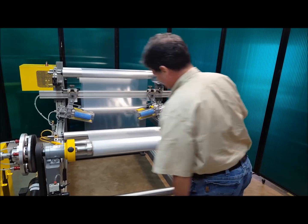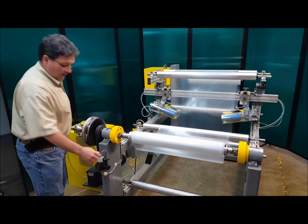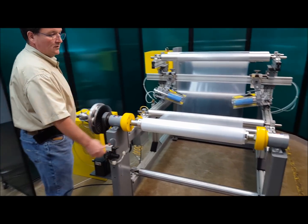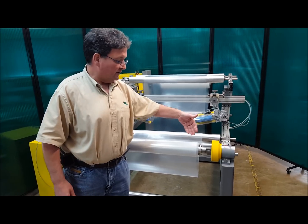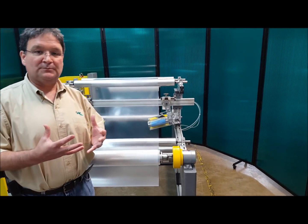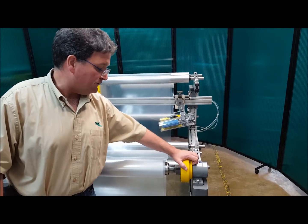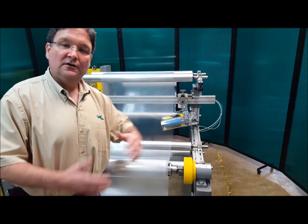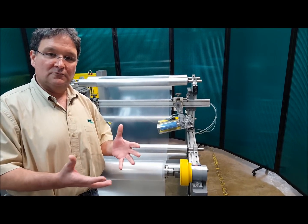So I'll show you that one more time — they're open. When I turn that rewind on, you'll see that they close automatically. CAC's safety chuck is somewhat unique because this capture plate slides linearly along the center line of the safety chuck. There are other designs out there where the plate flips open and closed. In my personal experience in the field, I've caught my fingers where the capture plate flips open — it flipped against my fingers and pinched them, and it was very painful.